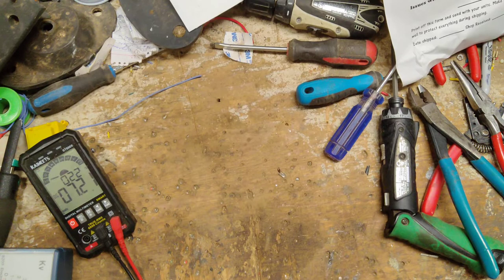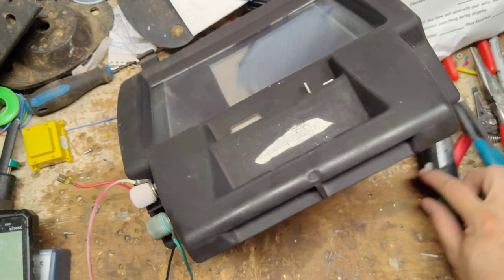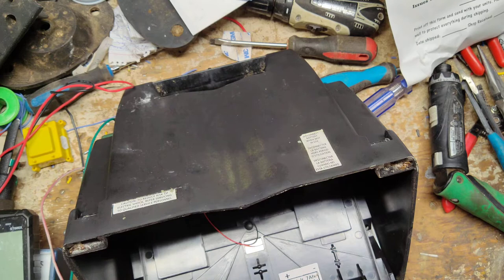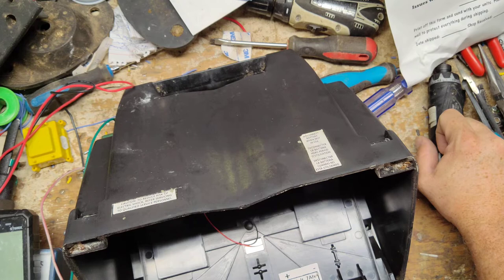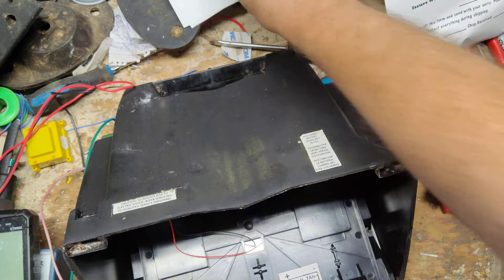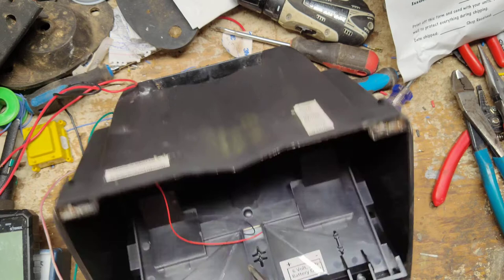So the main thing going wrong with it is the output of the board is bad. A low battery won't cause low output on its own. Fully charged six-volt batteries read about 6.4 to 6.7 volts. When they get down close to six volts — six-one, five-nine — they really start slowing down on their pulse speed, but it should still put out. If it gets much below six volts, like 5.8 or 5.6, it'll usually flash once and then stop.